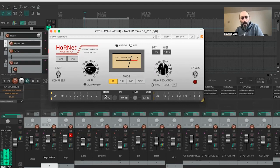So it makes perfect sense to use the built-in, but it's designed to be used as driving gain to the input transformer. Let's say you want to drive the transformer with a hotter level, you can automatically say, I want 2 VU, 3 VU. This goes up to 6 VU instead of the regular 3, because you may want a hotter signal to drive the input transformer. So it makes sense to use it in another way than you would usually do with the VU meter.